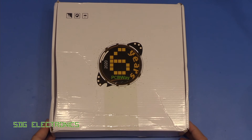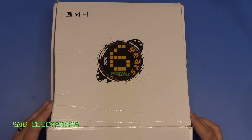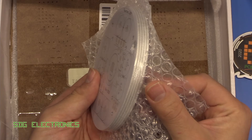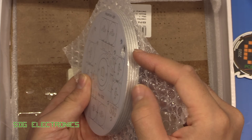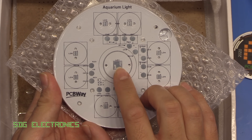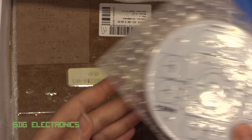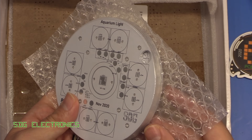So what we've got here is the first set of PCBs to support that — let's have a look inside the box. We get our free pen, a six years sticker, and then the PCBs themselves. We've got five of them. These are aluminium PCBs, two millimetres thick for extra thermal conduction, with a Cree XHP 70.2 right in the middle — a very high power LED — and then some coloured LEDs around the outside. At the bottom we've got a stencil for assembling these LEDs onto the PCBs.